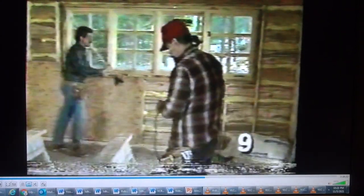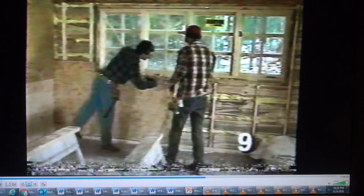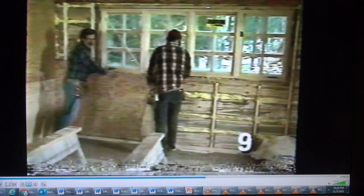That's to keep the cabinets at the same level as the mortar bed and tile we have in the rest of the kitchen. You'll notice that we've stuffed insulation in between the logs - it'll act like interior chinking and also beef up our R-value a little bit. To prevent the binding problem when the logs settle, we'll be screwing through the plywood directly into the nailers and not the logs. Once we have all of our plywood up, we can start installing the cabinets. Joy, are you going to be ready to help out then? Yeah, I've got just a little bit left here.